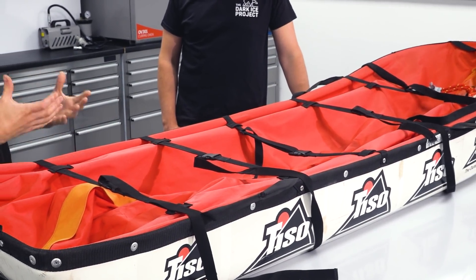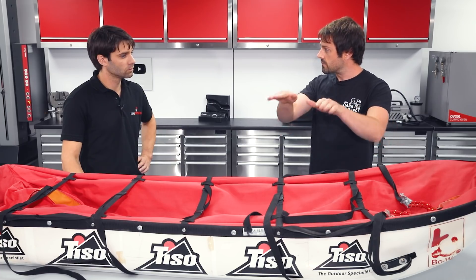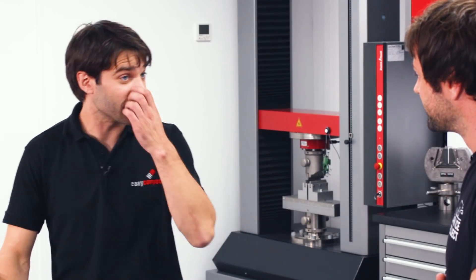Looking over the sledge itself, we're going to be redesigning it. You've mentioned this one is shallower than the sledge we're going to be making — what changes to the geometry and design do you need? They're going to be roughly the same length because we need the same high capacity for a multi-month expedition. The entire thing needs to be higher, particularly at the nose, so it can go over large chunks of ice without getting embedded in obstacles. We also need it to be higher at the sides so it can float across leads — the water gaps between ice floes. We sometimes raft them together or use them individually to cross from one ice floe to the next, either dragging it across wearing an immersion suit, swimming in front, or sitting on top using a shovel as a paddle — in the dark — with water temperatures hanging around zero, and then back into air at minus 45.